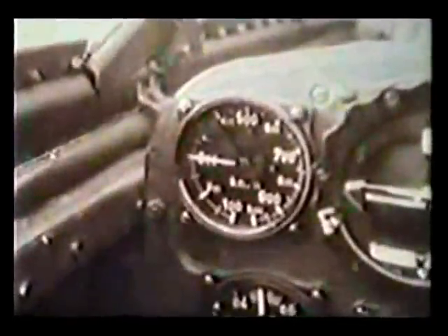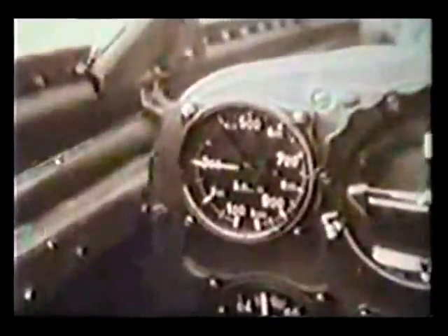As the other student listens in, the instructor notes that the procedure has been done correctly — the fuel was shut off before the throttle was brought back. The student pilot is pleased because he did it correctly. His speed gauge indicates that he has shut off the right turbine. Now he slowly turns it back on, pushing the button to ignite the fuel once again. He can then bring both throttles up again so that both turbines have the same revolutions.